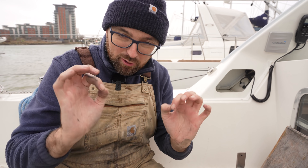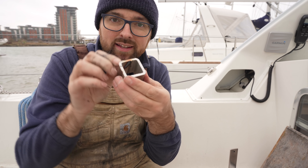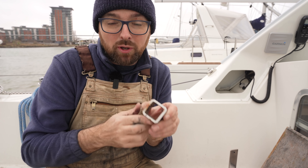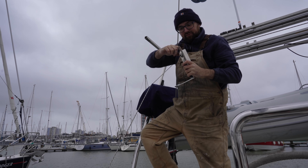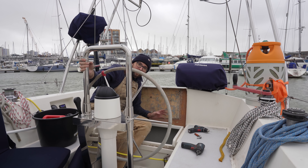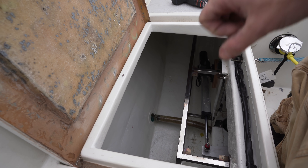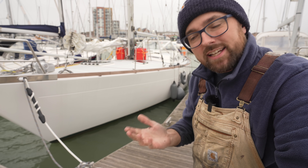The first adapter is in place and looking perfect. The second adapter however will not slide onto the arm, and I know why: inside of square tubing there is a little weld that takes up some space. I ordered square tubing that's 32 by 32 millimeters on the inside and the arm is only 30 by 30, so I figured that might be okay — this is not the end of the world. Next time I go to the workshop I'll bring this guy with me and I can just file down that weld on the inside. I've also got the frame covering the autopilot secured, along with the perspex that we're going to use to fill in the holes in that frame. There should be just enough room for the dive compressor behind there. With the frame and the adapters done, I've gotten a good start on the stainless jobs this week.